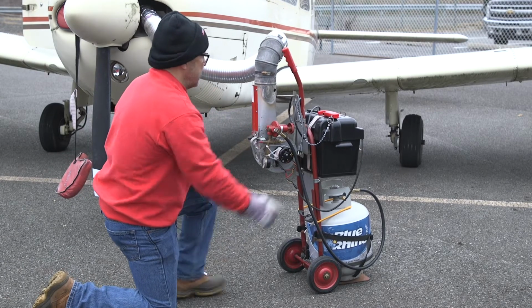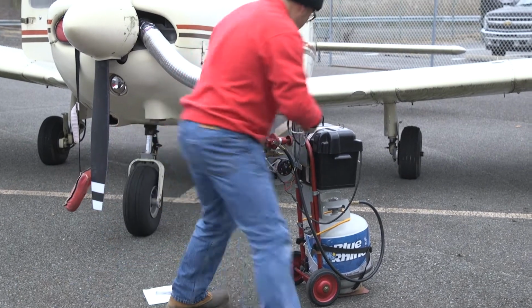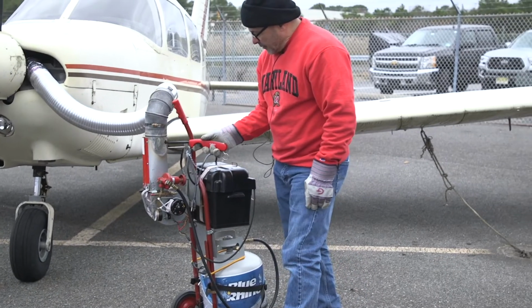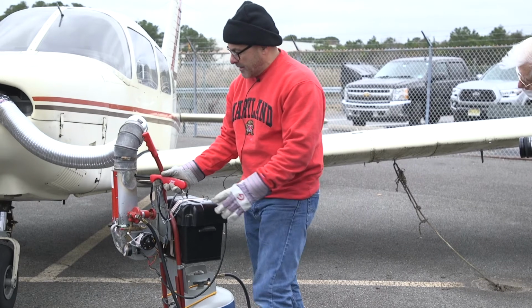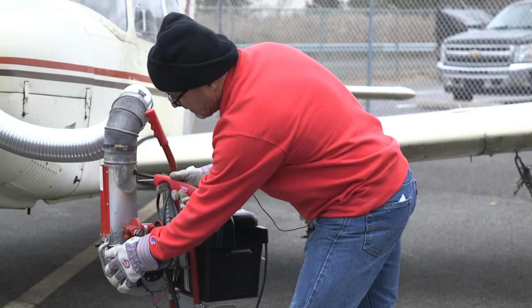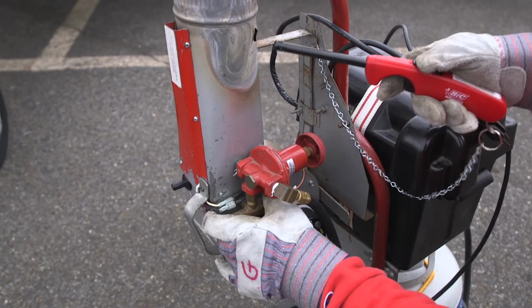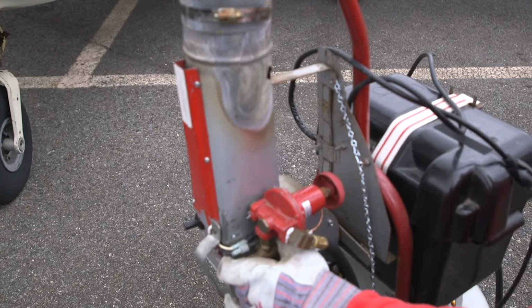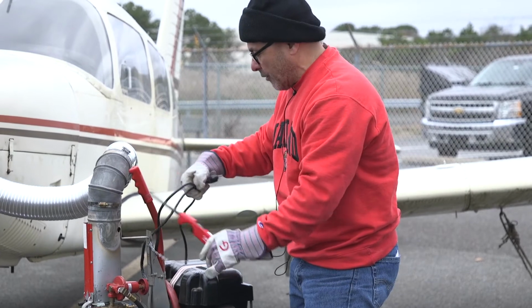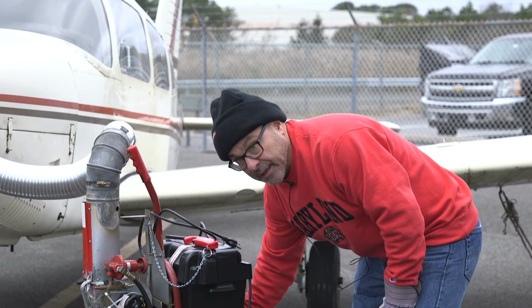Failing that, we have an igniter here, and again, sorry, I don't want to be in the way. There's a hole here where you can, again, you've got to be very quick with your hands. You would start the gas, click off the lighter, get ignition, and then reach down and turn the blower back on. Neither of these things will blow out, and it won't work if the blower's running at the same time. So that's why you've got to get it going quickly. But hopefully it's just going to light off with the igniter.